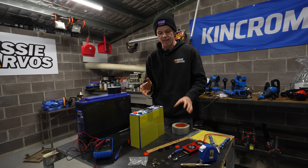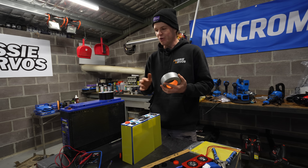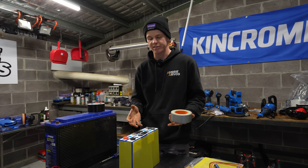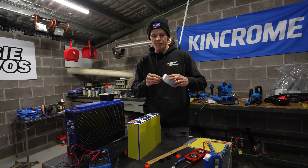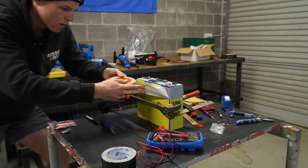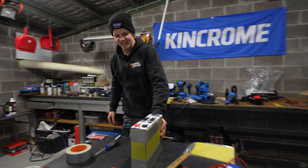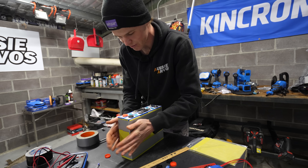When it comes to sticking our cells together, we're actually going to be using tape. That might sound a bit cheap but that's actually the way all these lithium battery cells are assembled, because it's lightweight, it's non-conductive, and because it's tape it's not going to be a hard surface that could wear through the battery casing and cause damage. We're going to be using cloth tape because unlike normal electrical tape it doesn't have any elasticity or stretch, so once we wrap it tightly around the cells it's going to keep them held tight and also help prevent the cells from expanding and contracting as they cycle.